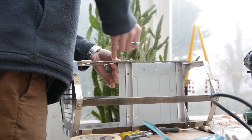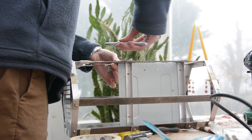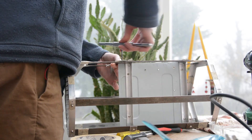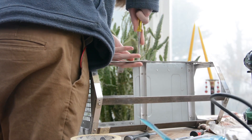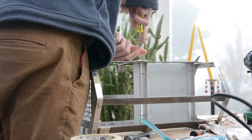The next part of the case to do is the power supply mount. For this I'm using two steel bars which will be screwed into the case, and then the mounting holes will be screwed into that. This required first lining up the bars, drilling through them and the existing steel bars in the case, before tapping them and then putting a screw in there.